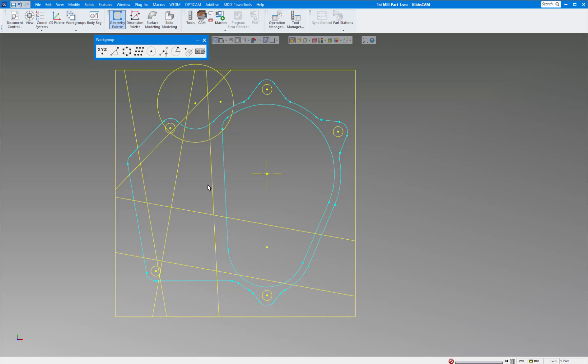Pick the Point command with no other menu and start connecting the pocket geometry, clicking through each intersection in sequence and using the double-point to stay in the command. Continue walking around and connecting each pair of features. The pocket on the left side is now drawn.